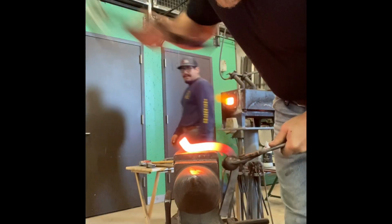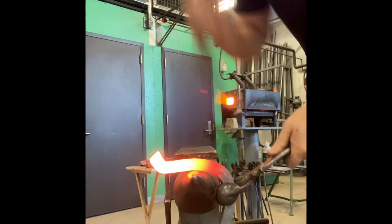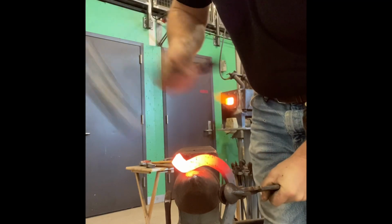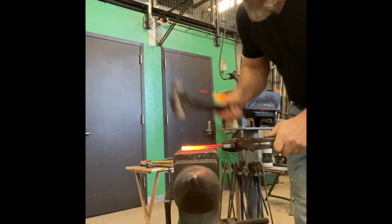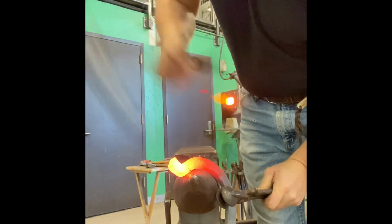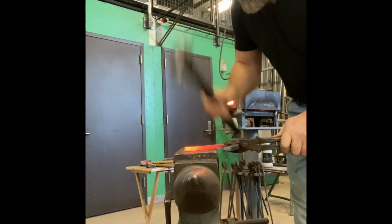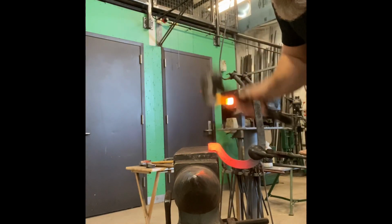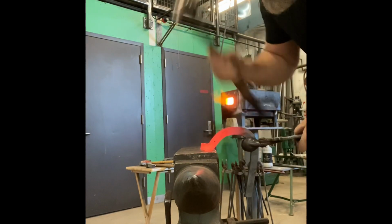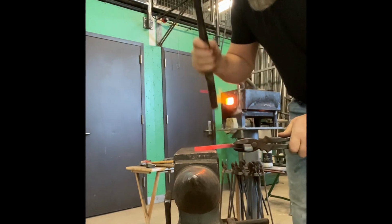Now I'm going to hockey stick this back in. I find that when I'm building these in the straight, where I need to turn them is about the same place I'm going to turn a bar shoe to hockey stick a straight bar shoe. So that's how I'll do that in the straight. Another quick bump to try to build up that corner. Now as I'm turning my branch, I take it all the way around until my trailer is on the horn, and then I'm going to bump it back in and build up that corner. Also sweetening that inside corner up there, just kind of gathering things up.